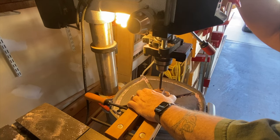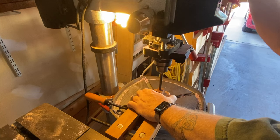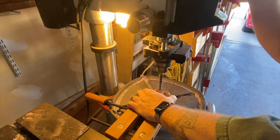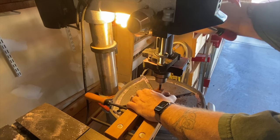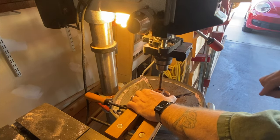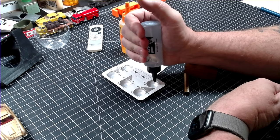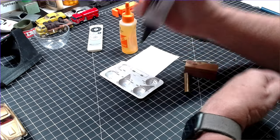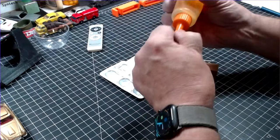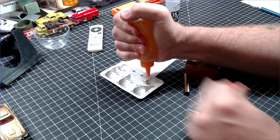But for a resin blank, you have to do that a lot more, or you can damage the blank with the heat that builds up. With the hole drilled out, I can now go and glue the pen tube into the blank. You can use CA or epoxy. I prefer epoxy, as I feel it's stronger and it'll fill gaps better. But CA will allow you to keep working, whereas the epoxy needs a good three hours to cure. This is going to slow your roll, so to speak.